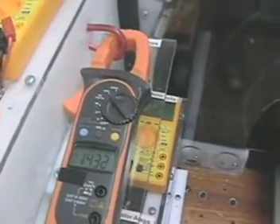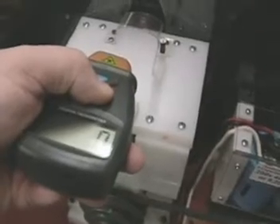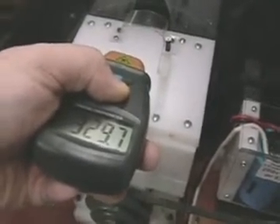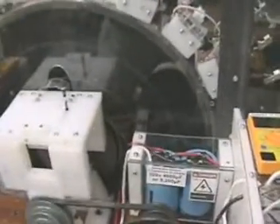Coming off the pulse motor back into the battery bank — that's 13 to 14 amps. You can see it's still climbing. The ratio is a little more than two to one right now. As seen in earlier videos, the mechanical advantage from a two-to-one ratio means the large wheel can run slower while the generator runs at a higher RPM. The large wheel is not going a thousand RPM, which means the material — like birch or MDF — doesn't have to handle that speed.